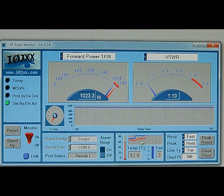The first temperature alarm occurs at 75 degrees centigrade with a red LED here. Then between 75 and 79 degrees centigrade the LED flashes, and if the temperature touches 80 degrees centigrade, the amplifier goes into protection. Obviously you must understand why the temperature rises so much, because this should not happen. For example, fans may be covered with an object slipped behind the amplifier.